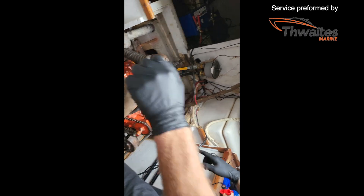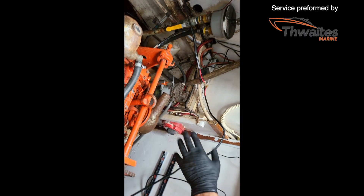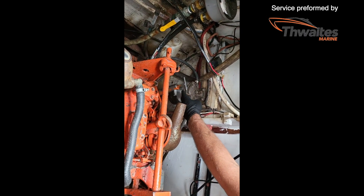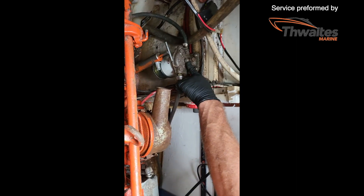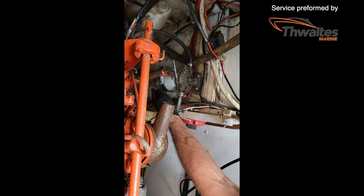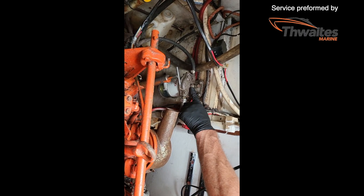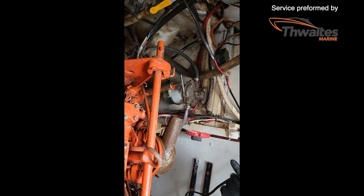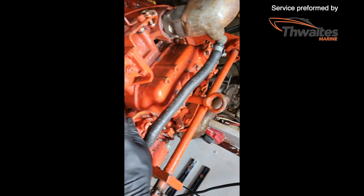Once you get all your fuel lines and your tank finally hooked up, we'll pay to chuck a new one of those in, and any of the truck shops will have them. Just the element — this part here. There's an O-ring under here, and they'll come with new O-rings. It all just sandwiches together — when you undo that you'll realize how it all comes apart. And there's the bleed — I'll show you how to bleed it. We won't be doing that one today but I'll change this one and show you how to bleed it.